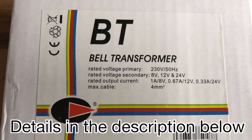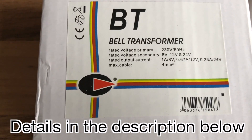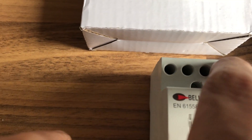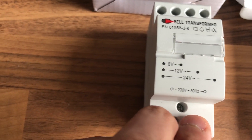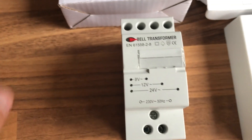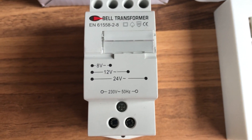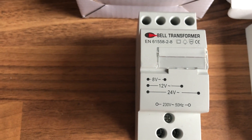You could make a note of the specifications. What you need is the 8-12 to 24 volt range — the Nest will work on 24V, so you have to use 24V. Connect one end to the 24-volt wires and your 230V would be connected here. You guys should go for the 16-volt transformer, and it should be specified for continuous use with 8 volt-ampere current output.